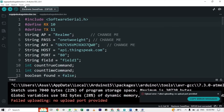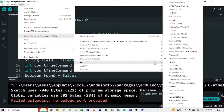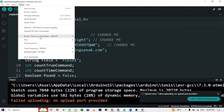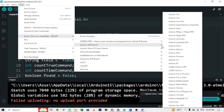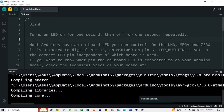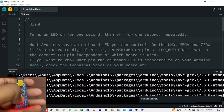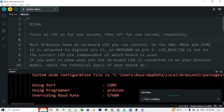Now that I've figured out my COM port error, let's start programming. This error typically occurs when the selected board is incorrect or when the board is not properly connected to the computer. Ensure that the correct board is selected in the Tools menu. You can also try changing the processor to ATmega328P old bootloader from ATmega328P. Sometimes if the RX or TX LED is blinking and the programmer is still not uploading, you can hold the reset button till compilation and release it when the uploading starts.